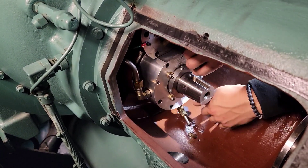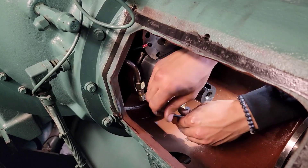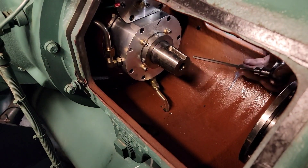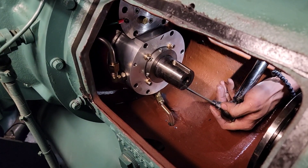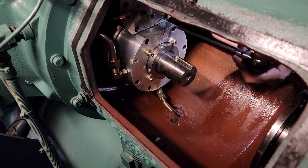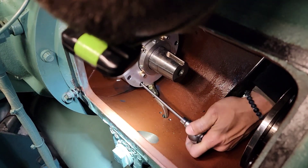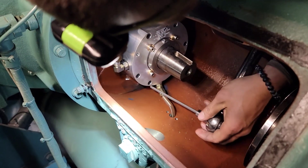Then we'll do our final torque specs: 106 inch-pounds on those six bolts. We'll also get the shaft ring set with the Allens and tie on the oil lines, then we'll be ready to start putting the coupling back together. We're not going to the full 106 right now — we're sitting at about 80 inch-pounds and then we'll step up to 106 on the last revolution, little by little. He'll make sure everything's set. Then we'll do the inner collar on the shaft and finish hooking up the oil lines.